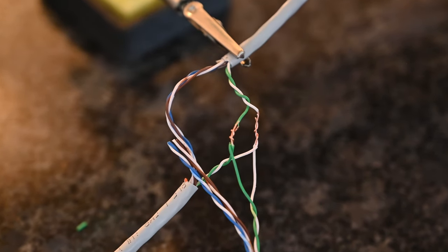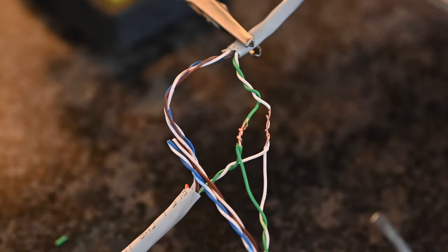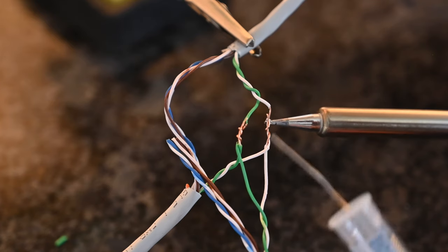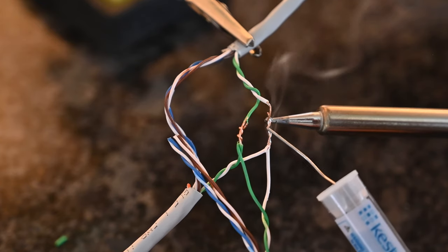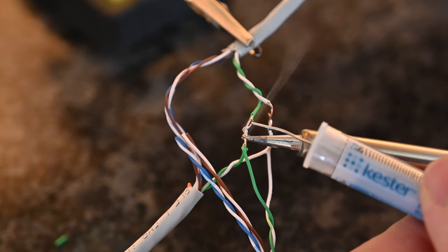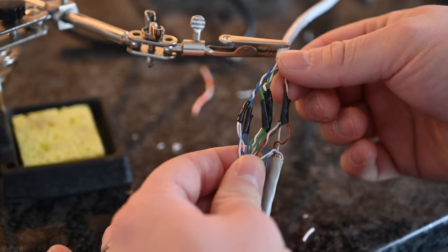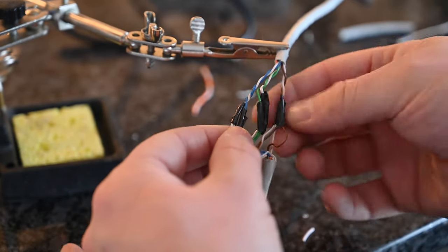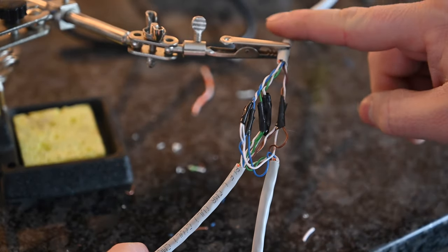Now, if you want to split your cable, you can do this as well — this is what I did to jump from the left side to the right side. A portion of the way down, I opened up the cable, removed the casing on the Cat cable, and discarded the orange portion because we weren't using those colors. I untwisted each of the others, stripped a little part with my knife, wrapped the cables around, and applied a little bit of solder to each of those so the wrap and the cable were all nice and snug, making good contact. I individually wrapped each with electrical tape before wrapping the whole bundle together. So I essentially spliced all the matching colors right into the middle of the cable where I needed to split it off — bridging over to go down one side of my cabinet and also reaching the right-hand side of the pantry.